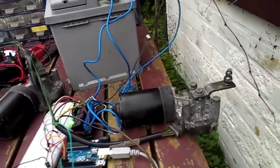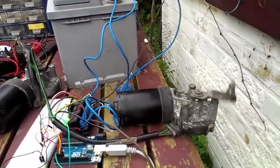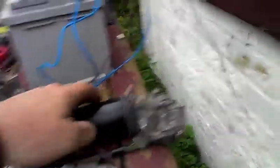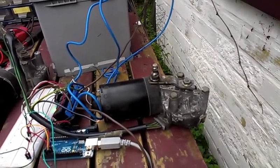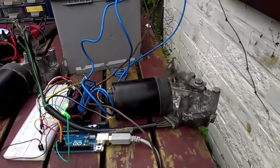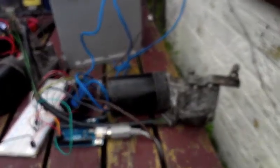This will keep going on and on since the program is just a dummy — a small program — but it shows that we can control the engine's turns and we can stop the engine. One thing I noticed is that when the turn is made backwards, the engine flips over, because there is no speed control whatsoever, so all the movements are very sudden when the engine starts. Gravity is showing the problems when you do a sudden turn. The engine is not mounted, but it might be necessary to have some sort of reduction in speed when doing the actual direction change.